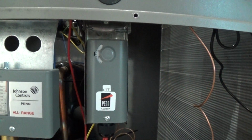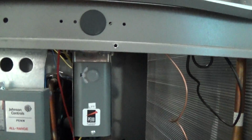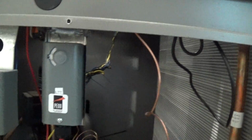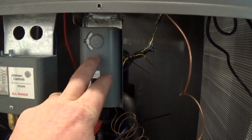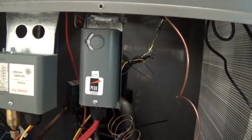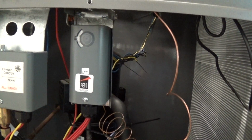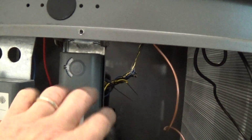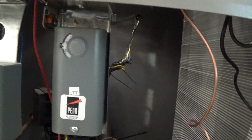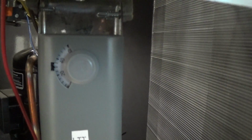If you are running a low temp application, meaning 25 Fahrenheit, in that range, below 45 Fahrenheit to 25 Fahrenheit, and running glycol, this does not serve any purpose. So if you do get the unit and you're a brewery, for example, or a low temperature application, take this screw off and turn this to its absolute lowest setting, which I think is 0 or less. Otherwise it ships standard from the factory set at 30 degrees.